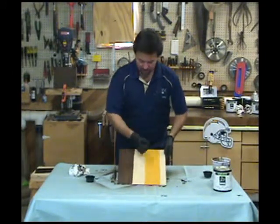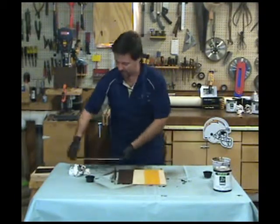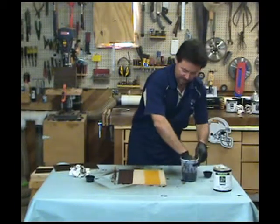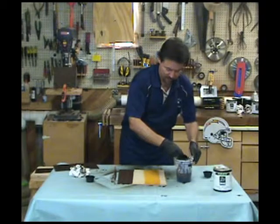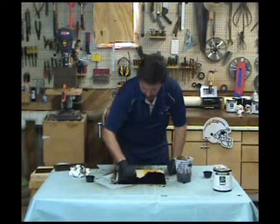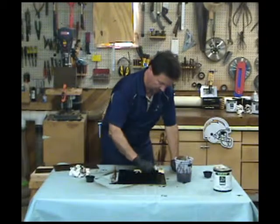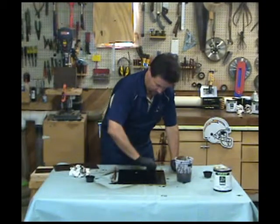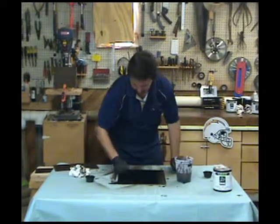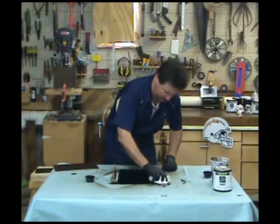You can see we've got these two colors here. I'm going to go solid in the middle. I've got this board just to back us up so I can isolate the two so you see the difference. I've got just a dark brown penetrating stain here — this is the liquid stain. Normally I would spray this on. I never try to be frugal when it comes to staining; that always gets you in trouble. Mop it on heavy and then come back and wipe off the excess.